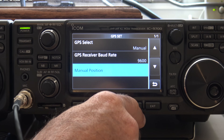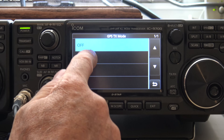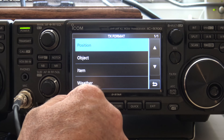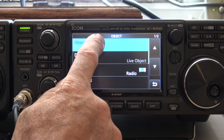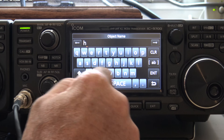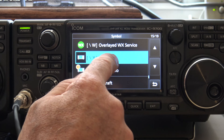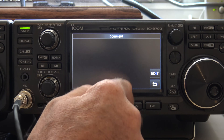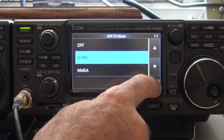We'll go back and do the GPS transmit. I want to transmit it over DPRS — that's over DSTAR — so it's going to transmit my position. Or I can set it as an object or weather station or whatever. We'll just do object, and we'll do home. I'll make the little symbol my radio. And a comment if you want — something like 'from Vero Beach' or whatever.